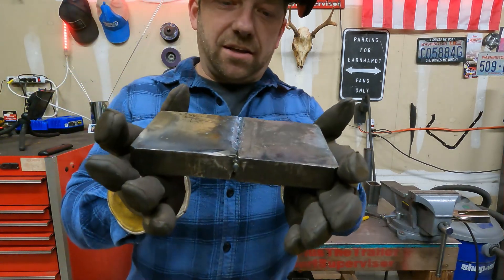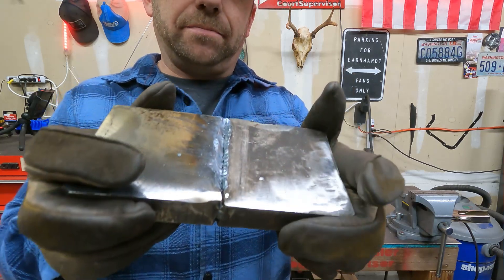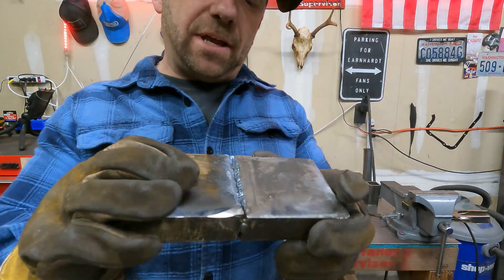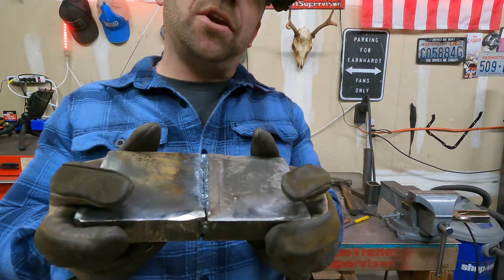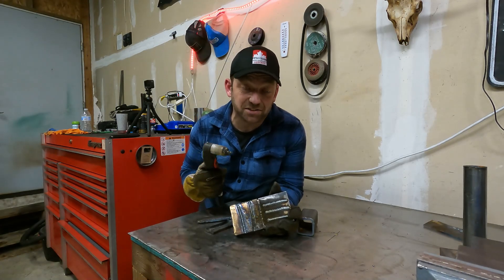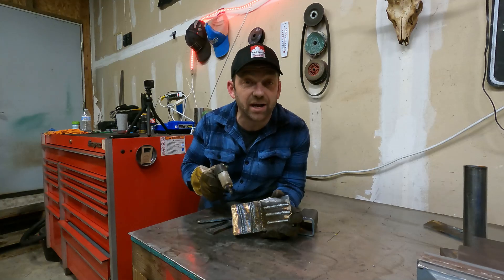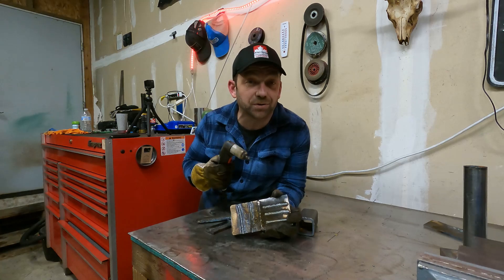There we go — a clean excavated weld with a slight groove I put in it, excavated real nice. If I were to spin all the way around this, it would be a very minimal cleanup and you've got two clean plates that are reusable with no damage done. Using a plasma torch is probably the most underused process when it comes to fabricating — it's more than just a tool for cutting plate. It can cut plate, gouge out weld, create grooves, and bevel plate. Get out there and get the most out of every tool in your shop.